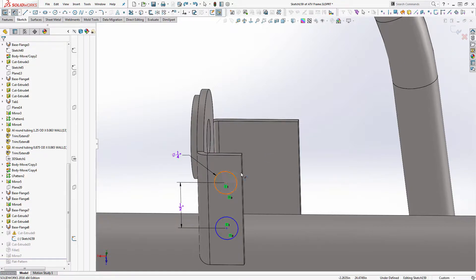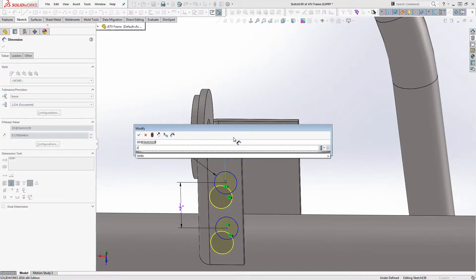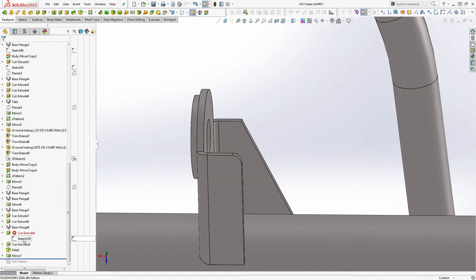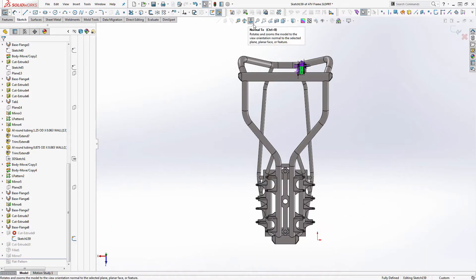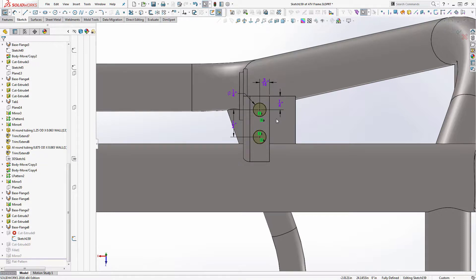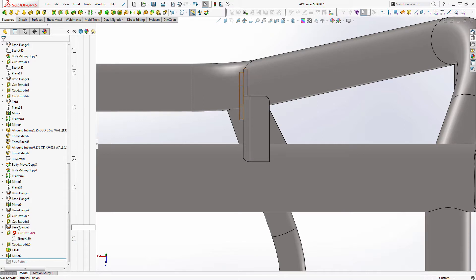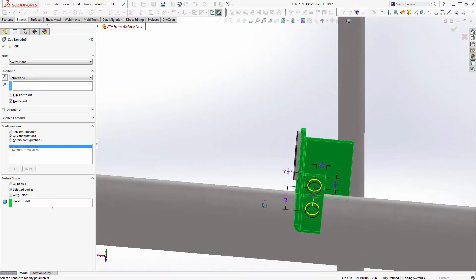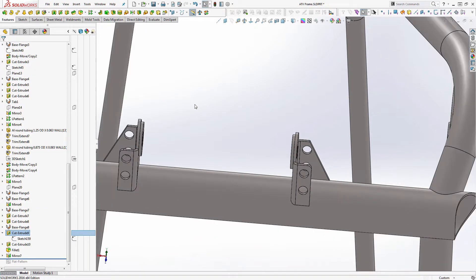Then we'll go ahead and reassign our edge information. We'll get this back to 1.875, and then get this quarter-inch — 0.25 — from the top, and hit OK. Now if I go back into my sketch and hit Normal To, my sketch is flipped over. I'm not looking from the top anymore — my normal has flipped, and I'm actually looking from the bottom up through that bracket. We'll go ahead and invert this cut extrude, get it going the other direction through all, and change the direction it's cutting. I'm only allowing it to cut the bracket itself.